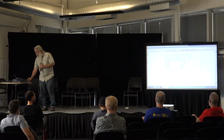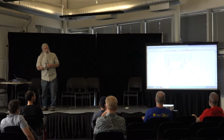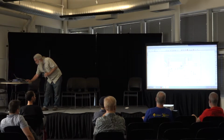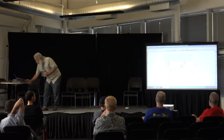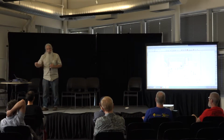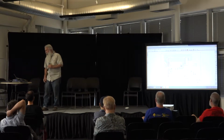The most important thing is you want to be able to capture the processor itself from the circuitry that's on the board. The KIM was designed so if you could expand it, you could put external ROMs and it would boot to your external ROMs. Right here, this is a signal called DECIN or whatever it is. If you ever used a KIM, you'd know you normally have to jumper that pin to ground in order to make your board work at all. Well, if you pull that high, that allows you to have your own external EEPROM on there. And so that's what I use it for.